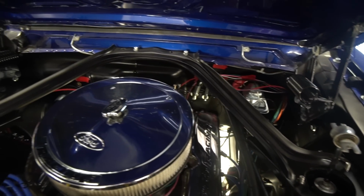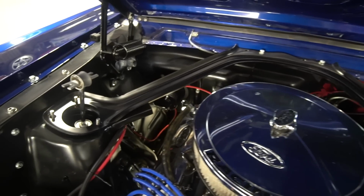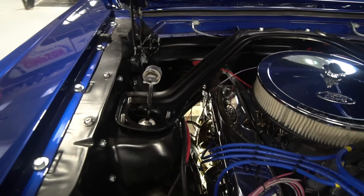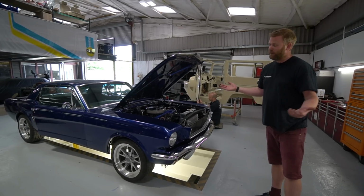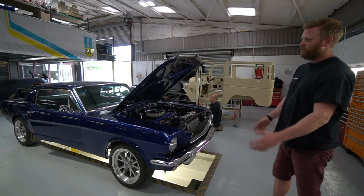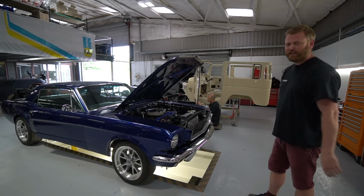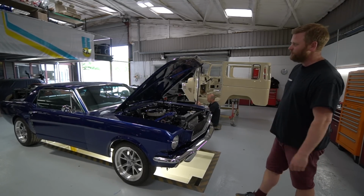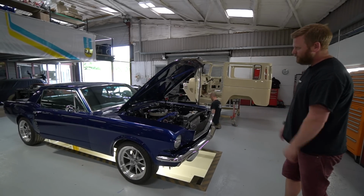But with stuff like anodising, we want to build it all up to a decent sized batch before sending it away, because it's very uneconomical to send stuff away for plating or anodising if it's just one or two parts, and actually unbelievably economical to do it as big batches. So we tend to have big batches set aside for each different colour and process, and build them up until they're a decent amount. So we're just waiting for a silver anodising batch to build up to a big enough amount to send those away, and then they'll go on. But it's nice to see the bumper on.